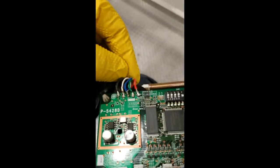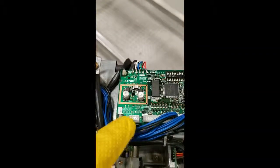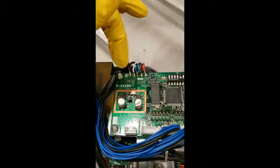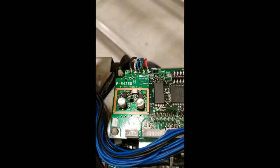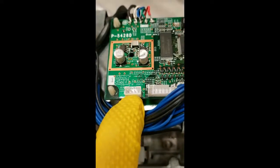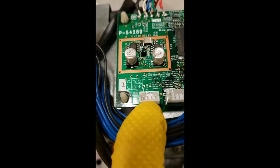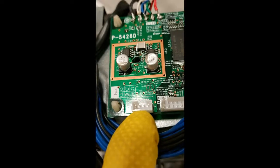Just one more note on load cell troubleshooting. Here you can see I've already soldered the new load cell wires to the new board. The signal from that comes out of this plug here. What we're getting here is we're giving it 15 volts on both sides. In the center we're getting back about 6 millivolts. What's going to come out of here is 600 millivolts. What it does is take the signal from the load cell and basically multiplies it by about 100 to go to the ADC card. And then it plugs into the top of the ADC in order from right to left.